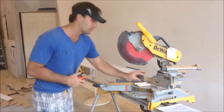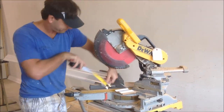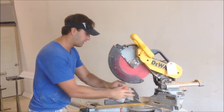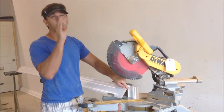You have to see what the height of this is. We're at four and an eighth. So you want to cut your piece that's four and an eighth — I already did, so I'm a little prepared. This is the same height as what this crown molding is. So that's how deep you want the crown molding to go from the ceiling down.